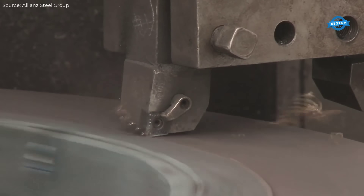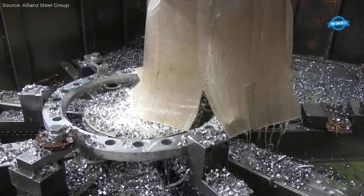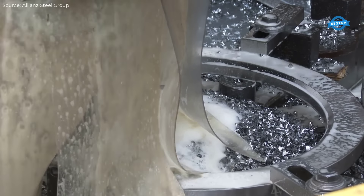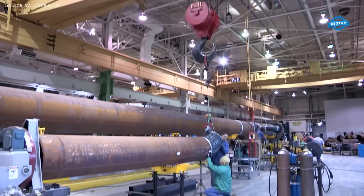In the flange production process, stainless steel is heated to the ideal forging temperature to make it malleable. The forging process begins with initial shaping through open die forging, where a hammer and anvil are used to compress the material. Punching is then employed to create bolt holes or other necessary openings in the flange.